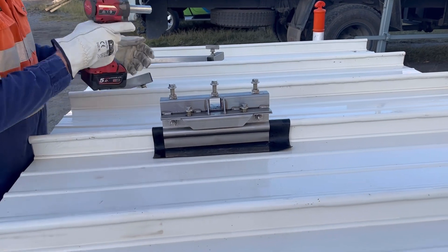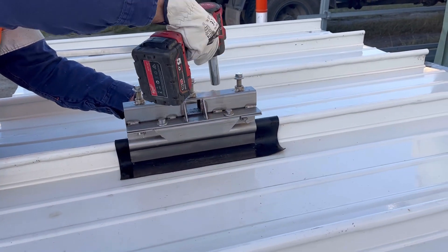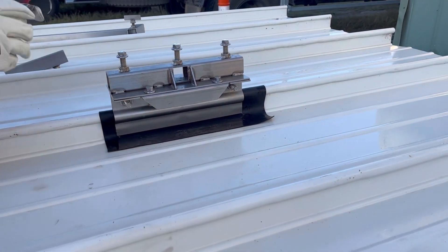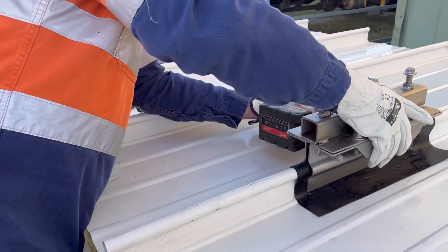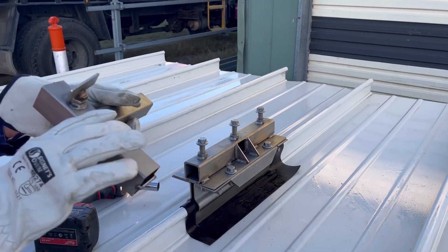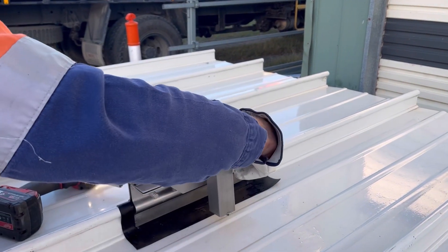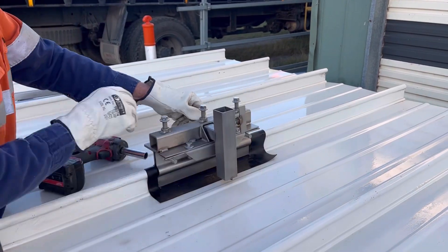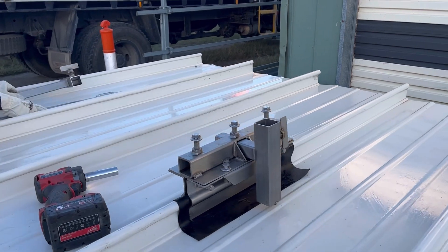Finally, if you're installing some rail along the internal of the roof — just where you've got a void or a penetration — you can use just a single bracket with a short T-piece. It's just a shortened version of the post support. You can't use this down the barge line, but you can use it along the gutter side or the ridge side of the roof.